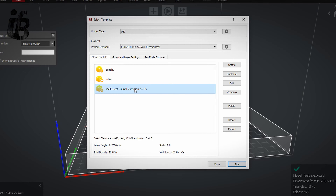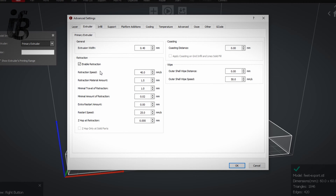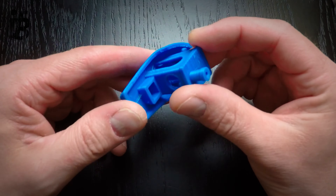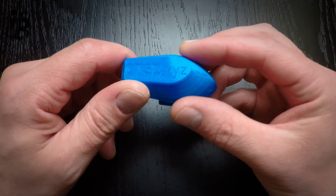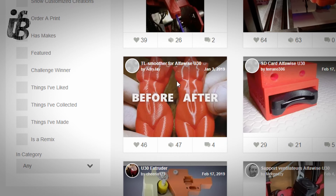Now for the bit I was more worried about — lowering the voltage reference on the stepper and it catching fire. Luckily this didn't happen on mine, and the only time the extruder gear goes forward and then back is because I've set the retraction settings up a notch to pull back some of the filament in between moving. I haven't had the need to adjust the voltage reference, but later on I might take a look at it just to see what the outputs are and whether they are in spec for the motors. My Benchy has the smallest amount of Z-banding and also a little bit of salmon skinning, but again only very slightly. I bought some TL Smoothers to fit in line between the drivers and the motors, and I will do tests on this later to see if these help.